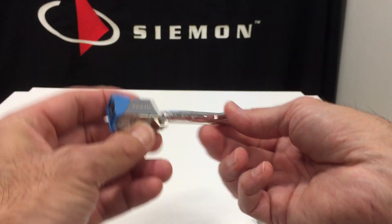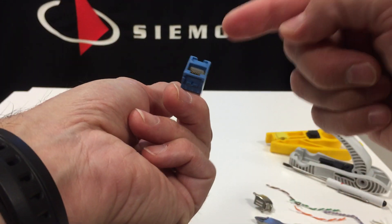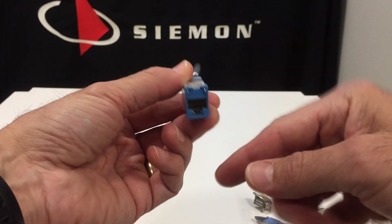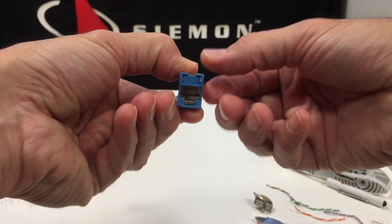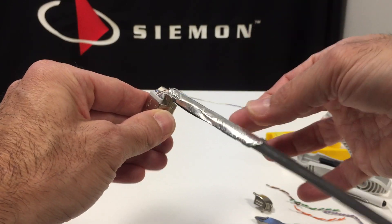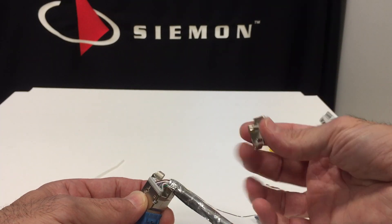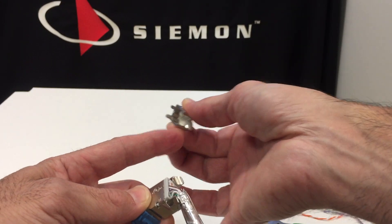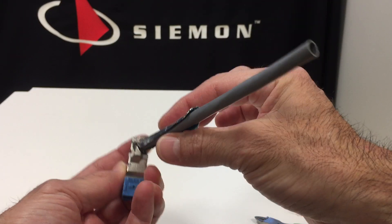At this point you decide which way you want your cable to exit. If your thumb latch side is down — which is what we recommend — your contacts should be up so you don't get dust settling on them. So if you're mounting this into a face plate, that's your typical orientation for a flat mount. You can either have your cable exit top right or bottom left. You just need to decide ahead of time. Get your cable oriented accordingly. Take your rear cover.